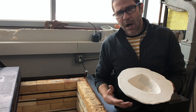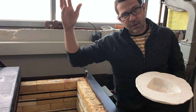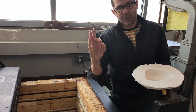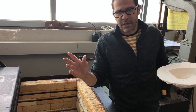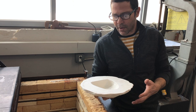The second thing is to properly dry your molds before loading them. It won't thoroughly dry them — there'll still be some residual chemically bonded water that won't be driven off until the molds are quite hot. But we want most of the water out. The mold should sound slightly metallic when tapped — that means most of the residual water has been driven off because we put it in a designated drying kiln overnight at about 100 to 220 degrees, which promotes evaporation without boiling the water. You can leave it in there for a day or two.